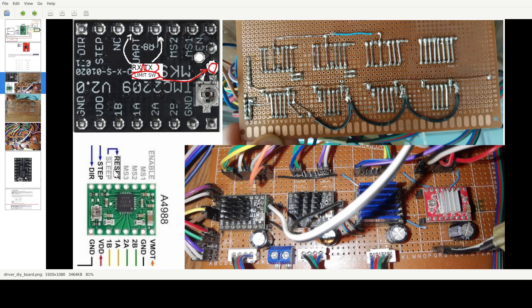That's how I'm providing the low voltage. Now back to the top — for the enable pin, because I don't have enough pins on the ESP32, I'm using a common enable shared across all drivers. So I'm going from here to here with this wire, then from here to here with this one, and from here to here with jumper cables — actually wires from a UTP network cable.